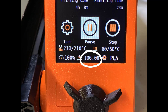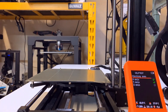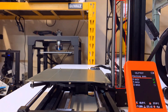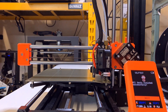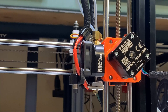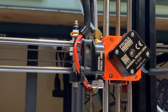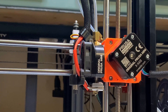The print actually stopped at 106mm. I will run the self-test again, and it seems the X, Y, and Z axes are all normal. But when you watch the Z-axis closely, the lead screw is slightly bent. However, the self-test did not find this issue. I try to manually move the Z-axis to see if there is any resistance around a certain height. When I try to move it up at around 100mm, you can hear something blocking its way, and I can visually tell the lead screw is not perfectly straight. I will loosen the trapezoidal lead screw nut a little bit. After trying to move the Z-axis up and down around the 100mm zone again, the weird sound was gone, so I will print the same model again.